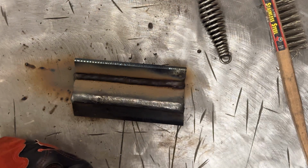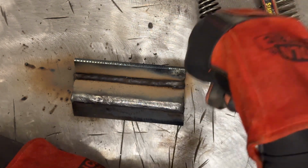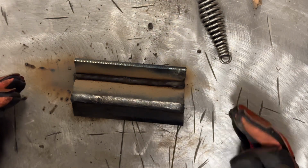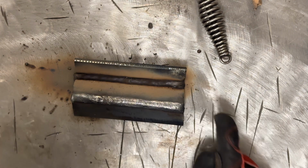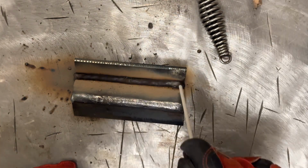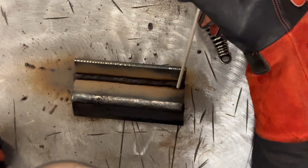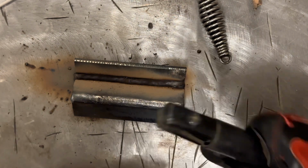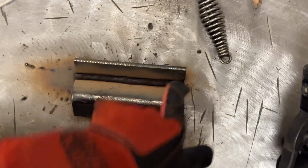Now, a couple things there. It might have been hard for you to see, but I ended up having to tip my stinger at a pretty weird angle, which directed the rod here instead of more or less here. So you want to be mindful of that, and that's something that I made a mistake on. I was still able to weld it, fortunately, and that comes from just having enough practice to be able to manipulate it just right to keep the arc going where I want it. But essentially what was going on was this rod was aimed in here, but it was then here, and the arc was literally coming through the side of the rod. Very easy to get arc blow like that, so not ideal. So always be thinking about where your stinger is. Rather than here, I would have been better off here, because then as I feed it in, what changes is the rod angle, not this way, okay?